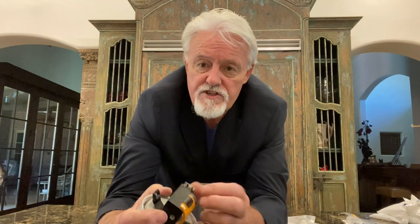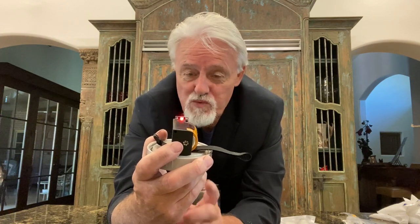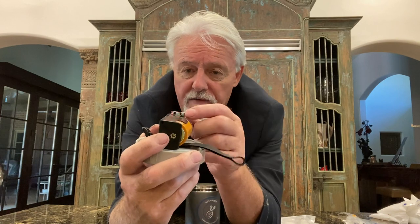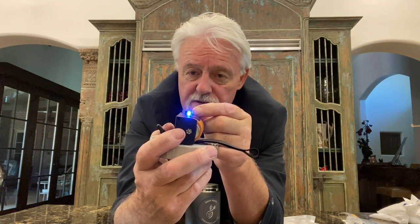One hour of data equals one second on playback. In this case it took about four hours to get down to green, which is five degrees centigrade. When the unit comes back, I can clear the data out — hold the button until it flashes blue, then hold until it flashes green. That's clear — ready for the next trip.